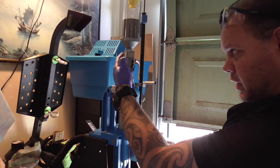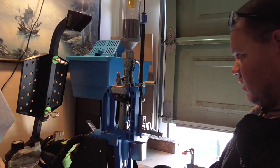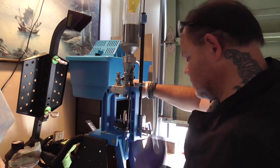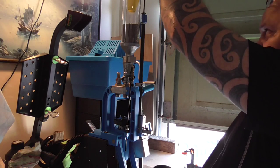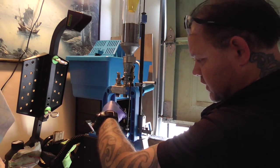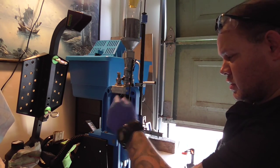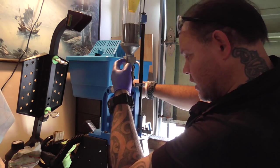That's loading the powder that's in here at the moment into the case, into the brass case. I come back, I push the handle forward slightly, and that fills this up again with powder. All right, and then I release. Now I'm going to dump this back into here, just to make sure that we're filling this up and getting the right amount. Saves us a little bit of time. One more time, pull it up. Okay, dumps the powder into the brass case, push it back up, reset this here for more powder to go in for the next one,